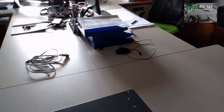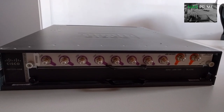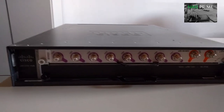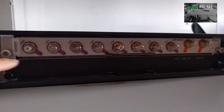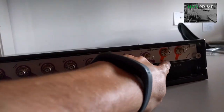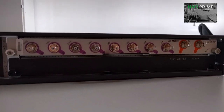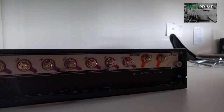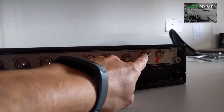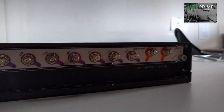On the other side of the cable modem termination system we have the ability to plug in two different line cards. One line card is inserted of version UBR MC88V, and you can recognize it by the different color settings that it is a DOCSIS 3.0 card. The cable modem termination system has eight upstream channels and eight downstream channels, with one physical downstream per port.